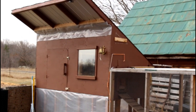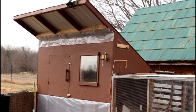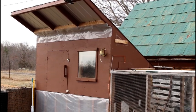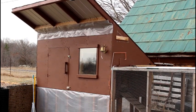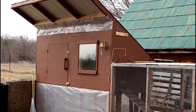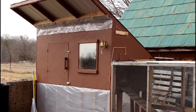We have a monoslope roof which leans to the back, and that allows for all of the water runoff to go to the back. There is no human access or chicken access at the back, so that prevents water and reduces the amount of water that might get into the egg door, or prevents the chickens from coming out if the water is pouring down on them.